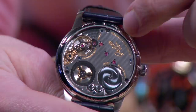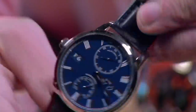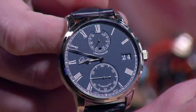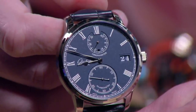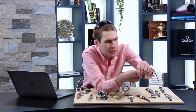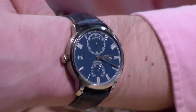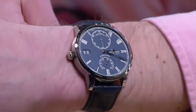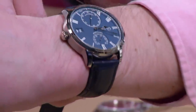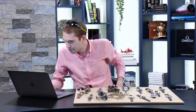The movement is worth your time: spectacular spiral graining hand-laid on one of two ratchet wheels, two barrels for even torque release, freehand engraved half-bridge, Glashütte stripes, jewels of the train set in chatons fixed with blued screws, engine-turned frosted finish on the base plate. As good as it gets from Glashütte Original — a brand making about 10,000 watches a year, essentially the Swatch Group brand with the most potential but the most neglected. An absolutely monstrous 42mm white gold watch with a lacquered varnished granular dial made at their dial manufacturer in Pforzheim.